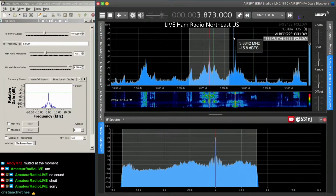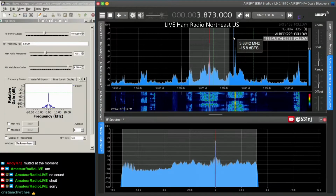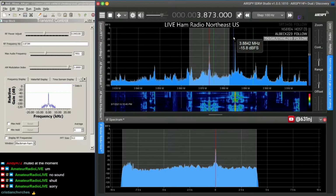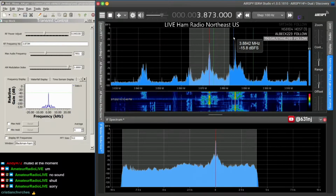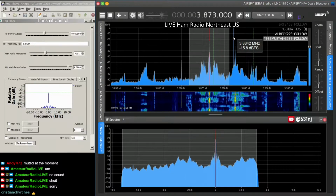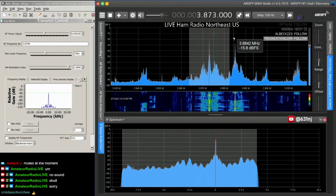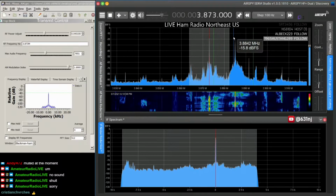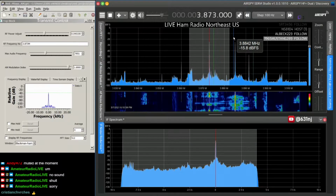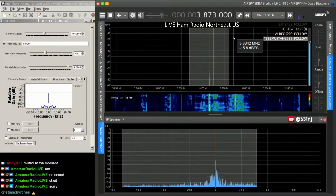Meaning on the RF gain control is not graduated that way, so what do you mean, Blaine? No, up in the top menu, up on your ribbon bar, you got where the AGC is. Right next to that, to the right of that, is attenuation. So I usually turn the AGC off, and I'll put like 12 dB of attenuation, sometimes 18, maybe 20.